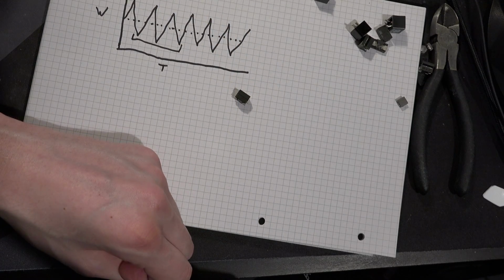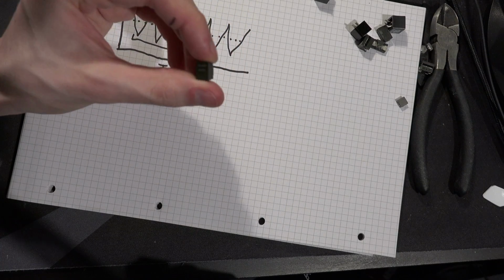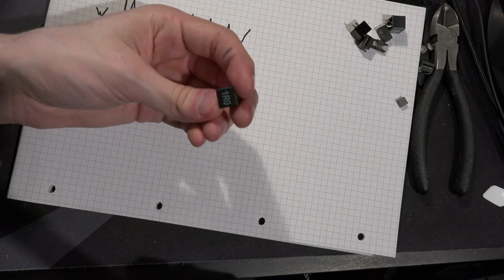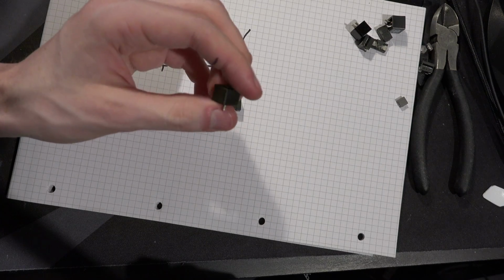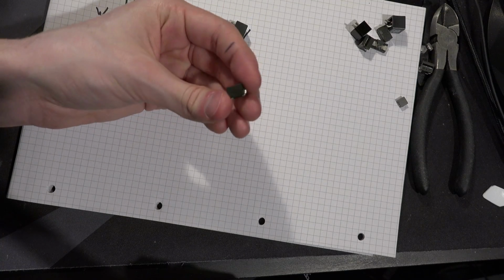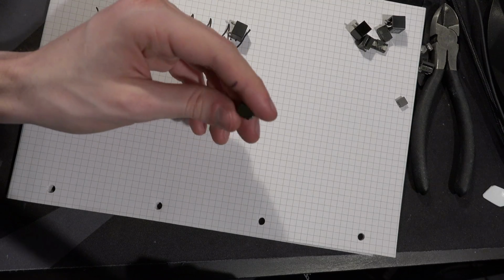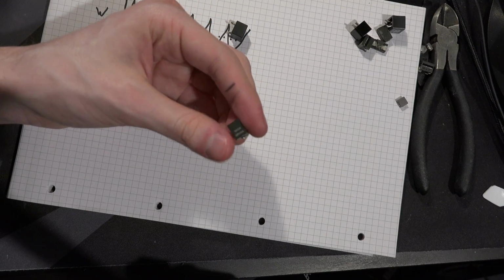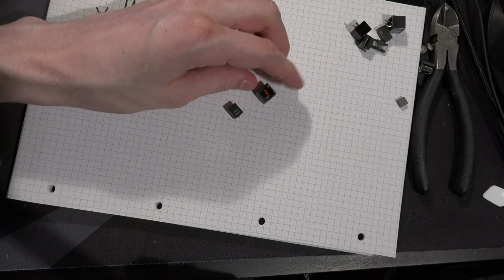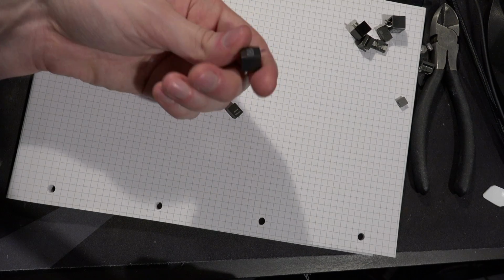So if you want to try to fix it, you're basically going to be looking at dabbing high temperature silicone or hot glue on all of the inductors that use this style of construction. Now, theoretically, these could probably also work themselves loose over time eventually. It's just that I don't actually have experience with that happening. But if I have a GPU with this style of construction, it probably has coil whine. So that's why I'm blaming these so much and not these so much. Though admittedly, these are really unpopular on GPUs these days, so it's kind of hard to test how bad these really are.